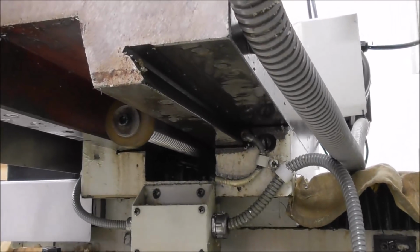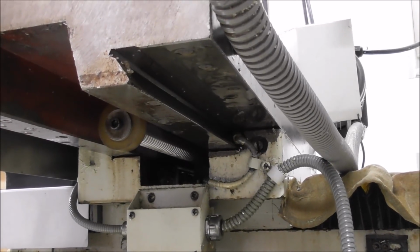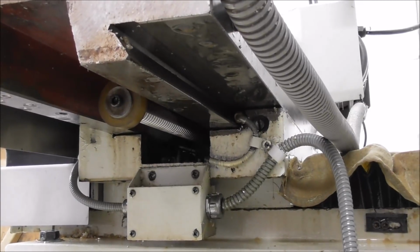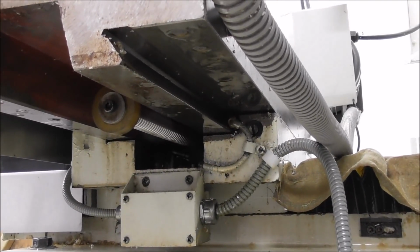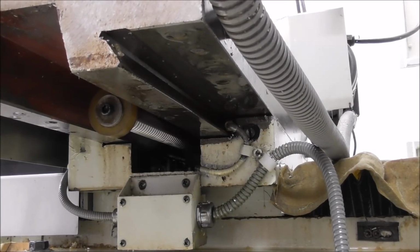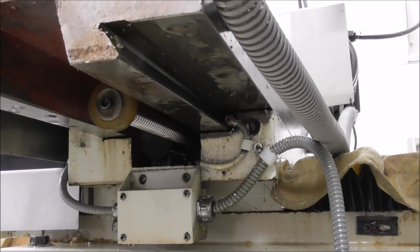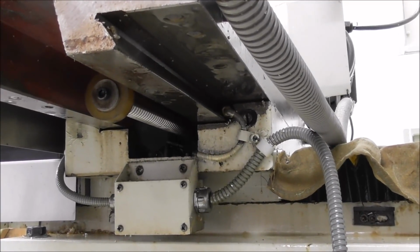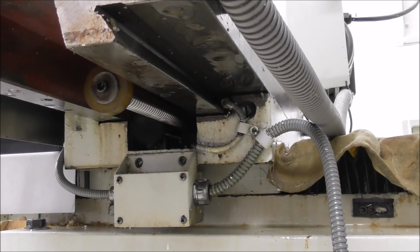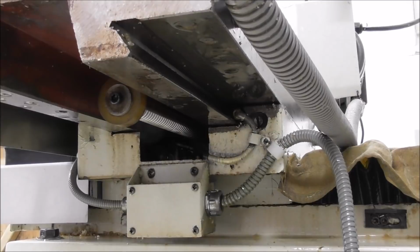Of course, these light CNC machines are not designed for that type of load, and the ball screw and nut is certainly not designed for high loads. There'll be a tiny load on a little brass slotting job like that, only a few kilos, well within the range of the ball screw and nut. But you wouldn't want to cut a big hefty slot in steel. You could very quickly overload it and rapidly wear out the ball screw and nut.